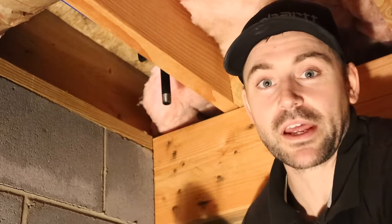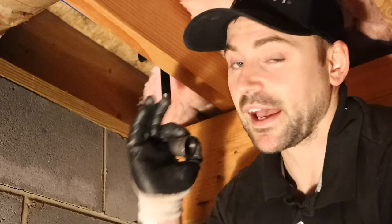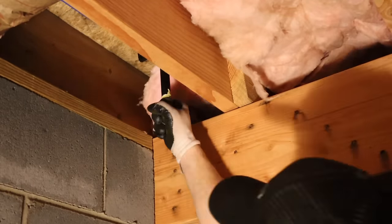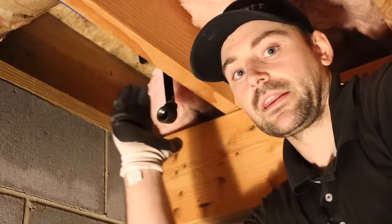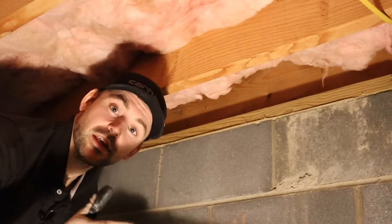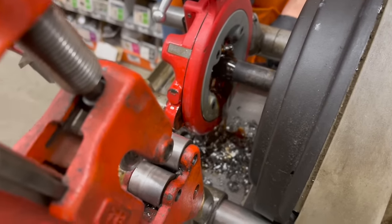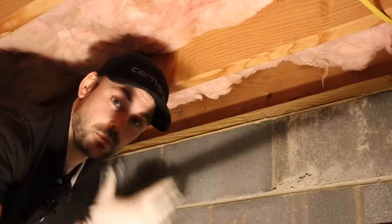Down here in the crawl space is that pipe that stubbed down from the fireplace. I'm going to use a reducing elbow, threading it onto the half inch and transitioning it to three quarter inch, connected the exact same way as the fittings upstairs. The next piece installed is a three quarter inch piece cut down to 58 inches. Just so you know, Lowe's or Home Depot will cut and thread your pipe for free — I had to buy a five-foot piece just to get the 58-inch length, which saves buying a threading machine that costs thousands of dollars.